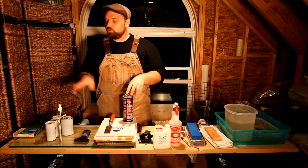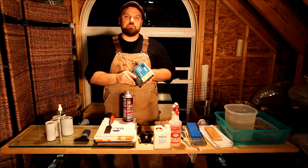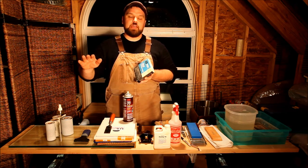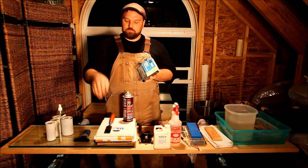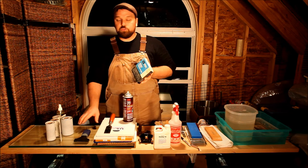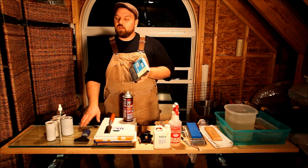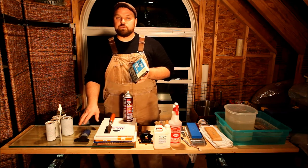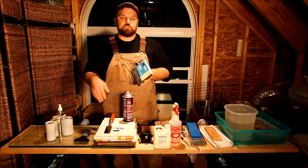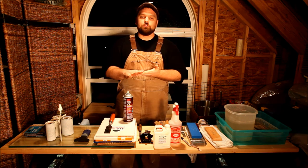To hone with this method, you can use buffing wheel compound just like with several other techniques. I've put this on a piece of cherry — I flattened the cherry and run the tool along it, and the buffing compound does a great job polishing the tool. You can also do the same thing on the glass sheet with a plain piece of notebook or printer paper adhered to the surface. Put a little buffing compound on and it works just like a regular hone. You can also use leather glued to a flat surface.